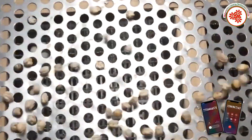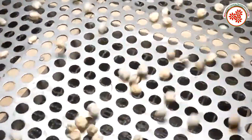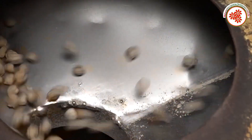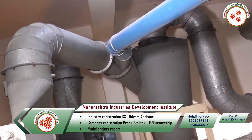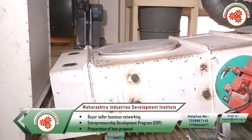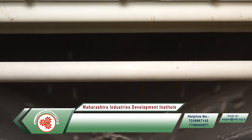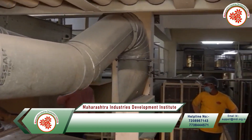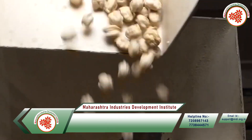From the storage tank, the gram is fed into the cyclone separator, which cleans the gram by removing dust. After this, the chickpea is sent to the D-stoner. The collected dust goes into a big dust bin, while stones are removed from the gram. Then metal particles are separated and collected in another cyclone, from where the gram goes to the classifier separator, where leaves and sand are removed.